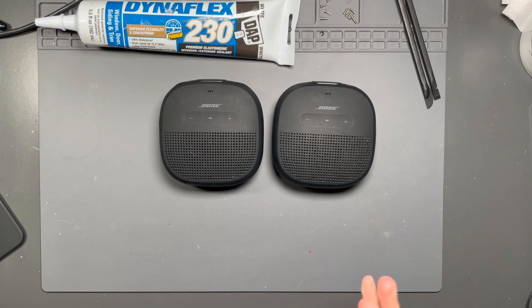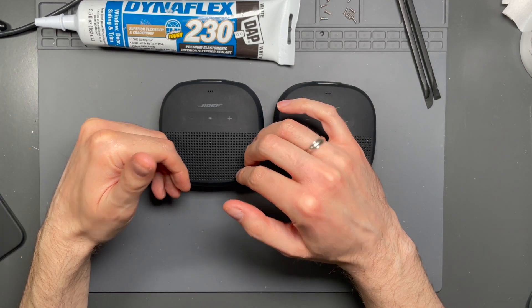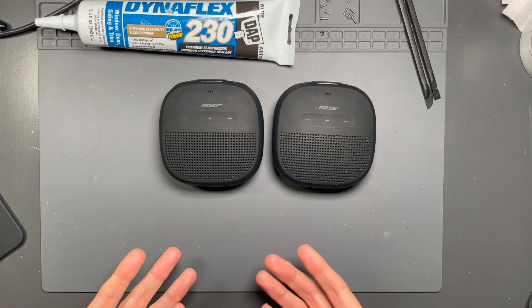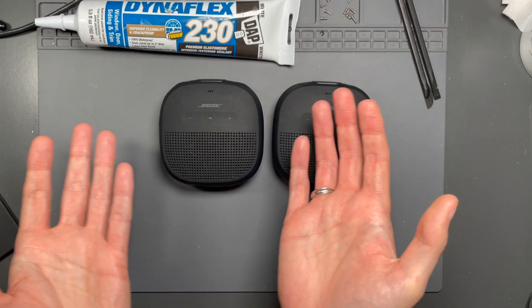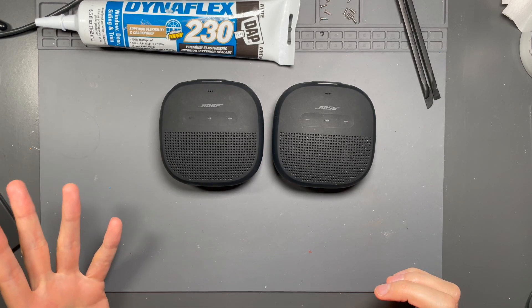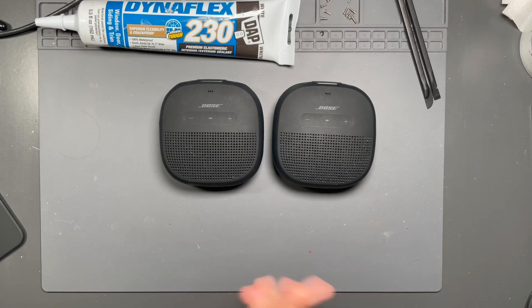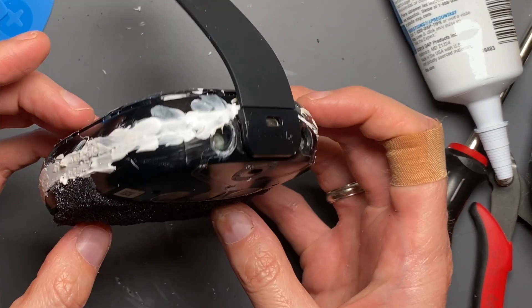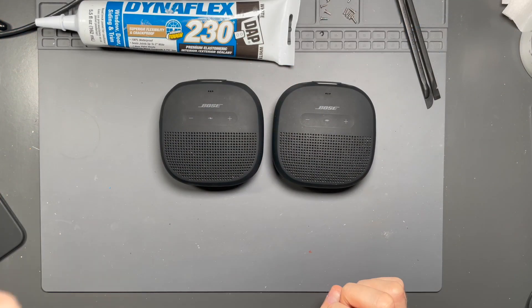I do feel like the modification — obviously removing all the clips to get inside and putting the elastomer sealant on it — has caused it to have a different resonant frequency for the enclosure. Perhaps that's occurring at a much lower frequency, where the enclosure may be moving in a destructive interference pattern where you just don't hear it. If that's a concern, one thing you could do — even though it's kind of a one-way trip — is instead of using the sealant first, consider using a plastic cement to adhere the two pieces of plastic to each other, then finish it up with an elastomer sealant to waterproof it and keep air from getting in and out so you don't get any whistling. I'm pleased with this — I am satisfied with how it came out.